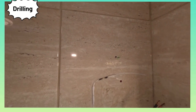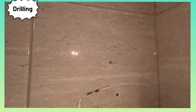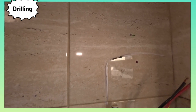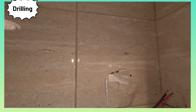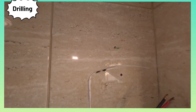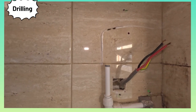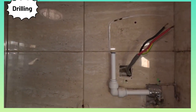Just don't go in too fast - you never know what's behind. Some short 6mm screws. The shower's not heavy - it's all supported by the pipework. I normally use a hoover when I'm drilling but it's difficult. If these were porcelain you'd need proper porcelain bits, but ceramic is easy with a nice sharp drill bit. That's my holes done.